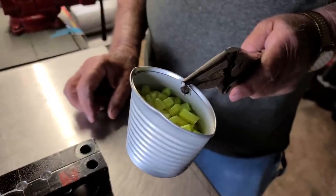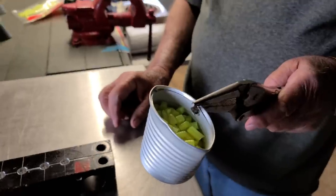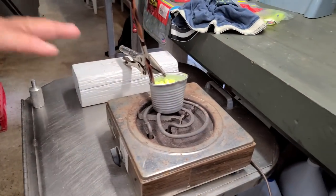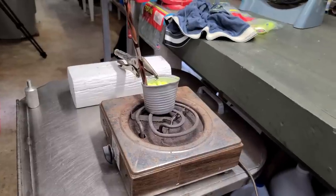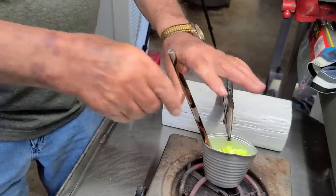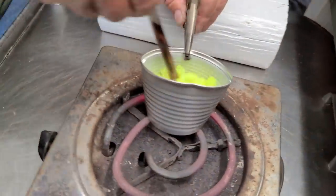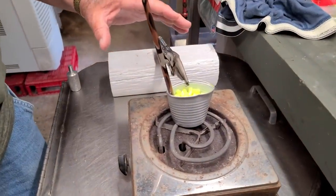I take a pair of vice grips — that's the reason I put that hole in my cup — so you've got a disposable pouring can. I'll set it on that burner. You don't have to do nothing but stir it once it gets a little hot. What the lead does — I was scorching it no matter what I turned my heat to, and someone told me I had to have lead in it. I put in two little pieces of lead and I ain't had no trouble since. That was like 20-some years ago. The lead absorbs the excess heat — that's what he told me and evidently it worked. You used to use a microwave — you'll see in a minute when this gets hot why a microwave wouldn't do me no good.